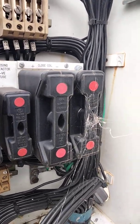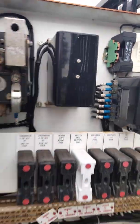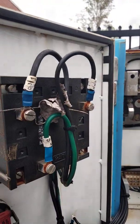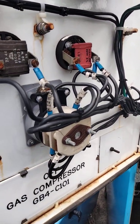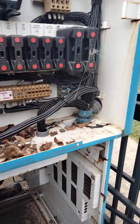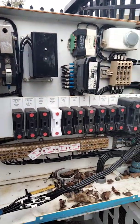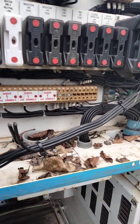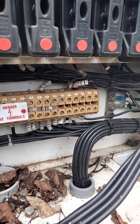The coil is quite big because it draws a lot of current. We have the heater thermostat up the top to keep the cabinet warm and keep moisture out. A lot of this old cabling is all numbered — it's good stuff, done nice and simple. The control wiring is all black. The only problem with that is if you lose a wire number off the end, you have to physically trace the cable out. All of this comes down from those fingers up to the control circuit here, and this is what helps control the OCB in and out. You would follow a drawing. We have all the terminals down here telling us which cables are live and which ones are control.